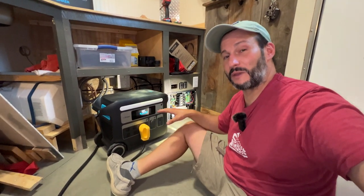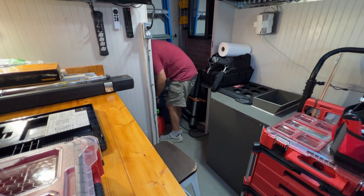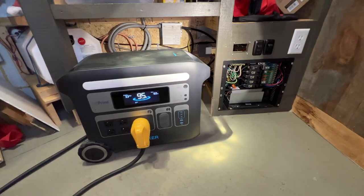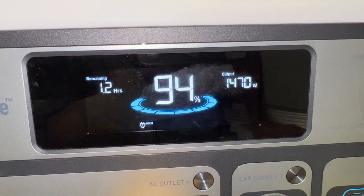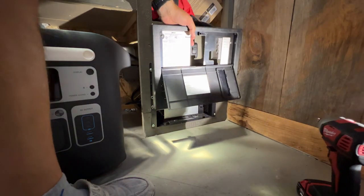I think now I need to test out my AC off of the setup and then start putting things back together. I'm going to swap my cord back to the wall outlet — got to wait 30 seconds. All right, we're back to the Anker. Let me turn the AC back on. It's pulling 1,400 to 1,500 watts — about 200 of that is the trailer itself. Because it's so hot out it is going to pull some pretty high wattage, but it's not too bad. With both of these batteries in here, it gives me about two hours of runtime.